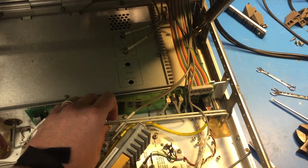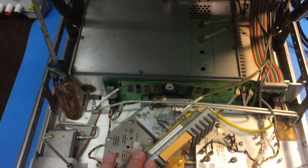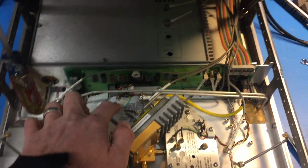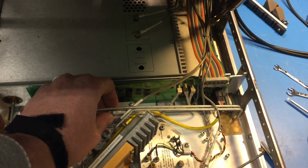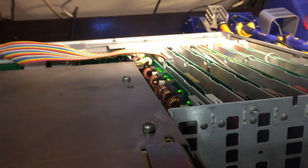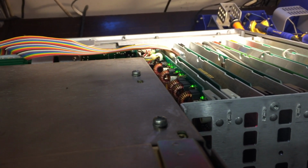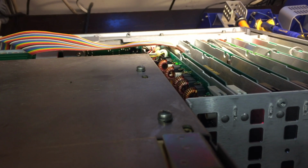Okay. I think it has to do with when it tries to phase lock, because we're all powered up. Everything is connected to the other channels, but this one is the phase lock channel. And when I hook up the IF, see, there's no short circuit, but I'll pop the IF in. This is where you sample for phase locking. And, oh, there it goes.